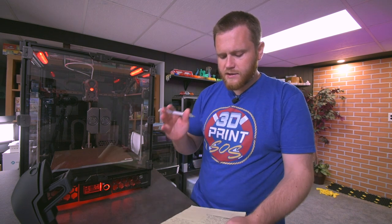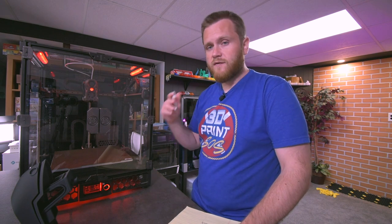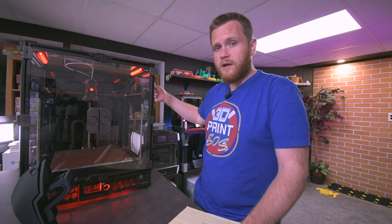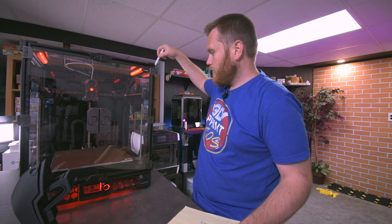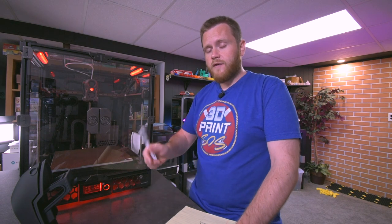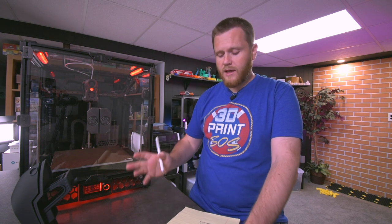The chains are just stuffed with wires. As you guys might have seen in the build, all of the wiring in the basic version of this machine, all the wire from the tool head and the X and Y stops, goes through the looms, through the cable chain, starting here, all the way going back this way, and then down the machine and onto the bottom. There are a lot of options nowadays, but this machine comes with those cable chains just stuffed. And I actually had a few issues.